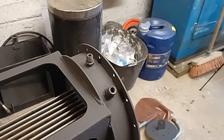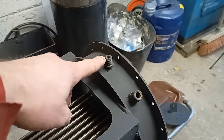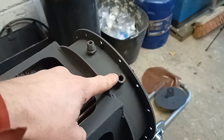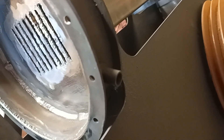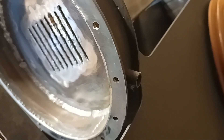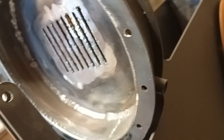I've welded various bosses and stuff on. This one here is going to have the stop valve on it. This one's going to have a pressure gauge on it. And this one down here is going to have the non-return valve — so it will let air into the engine but won't let it escape again. As long as there's no air leaks, I'm not expecting this engine to lose a great deal of air, so hopefully that one won't see too much use.